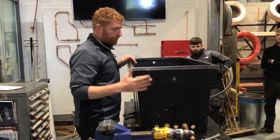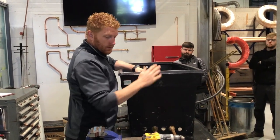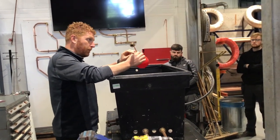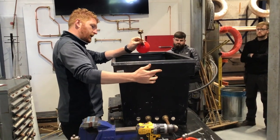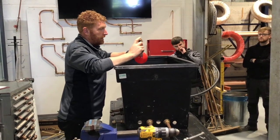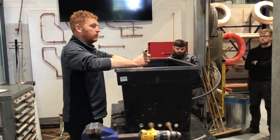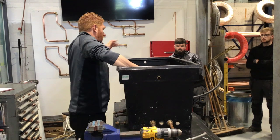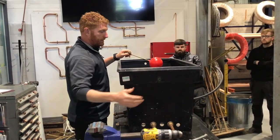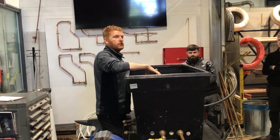To feed your tank, you're going to have mains water coming in. The mains water comes in through the ball valve, and that will be connected to the top section of your tank through a 19mm hole — which is here or at this end. You always put the connection at the far end from where you've taken off your draw points. That's to ensure a good flow of water and make sure that nothing gets stagnant.